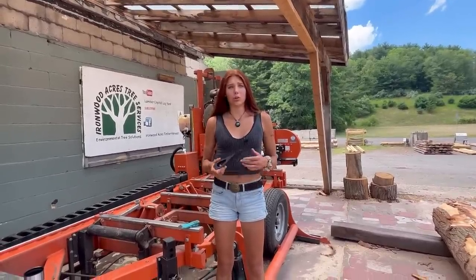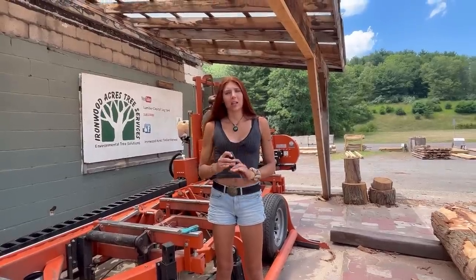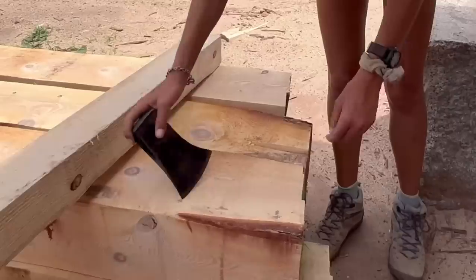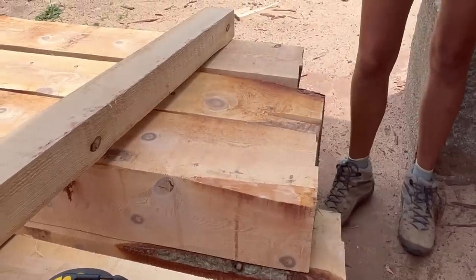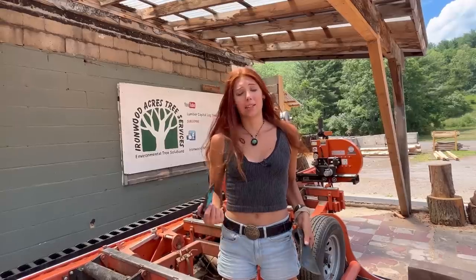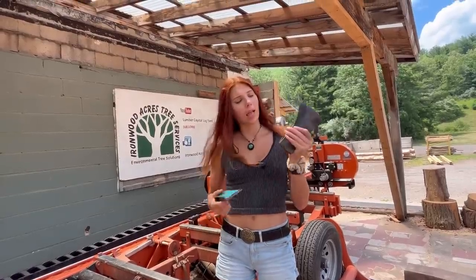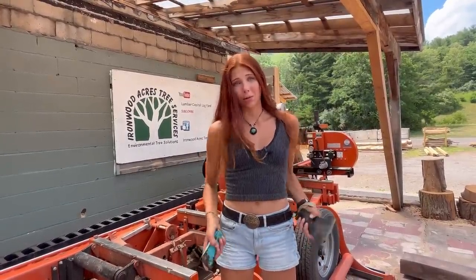This is also a very handy tool for debarking a side of a board. Say the board is fine but there's a little bit of wane on it — we'll use the axe head to take off that wane, and it just pops it right off. I find it important to have two different sizes because it really depends on what you're using it for. If it's a very thick log and the blade didn't make it very far through, something smaller works better to jam in there. I keep these very close at hand because I use them all the time.